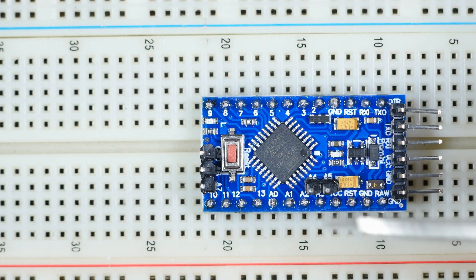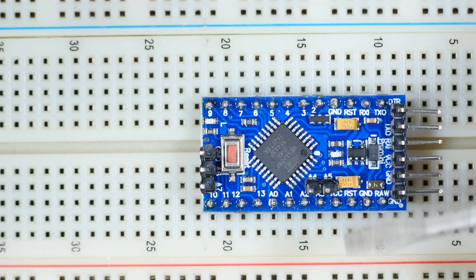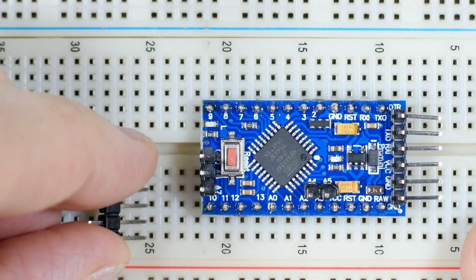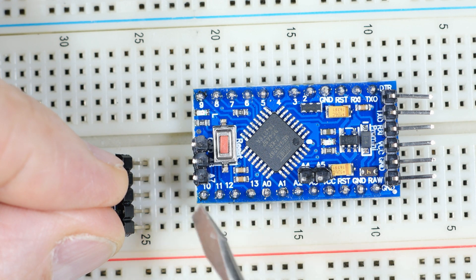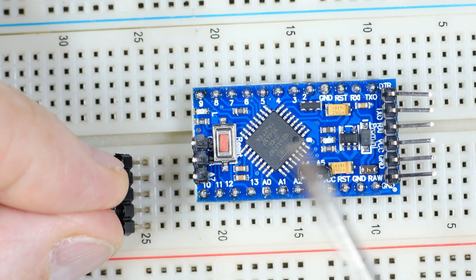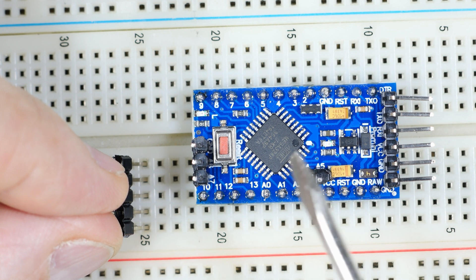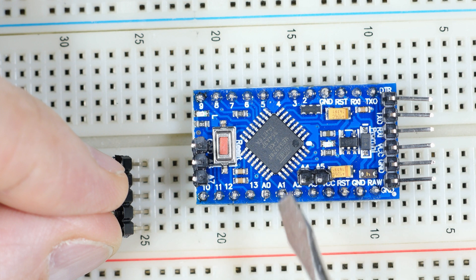Even if these pins lined up — like these three back here — why did I put these three standing up? Why would you not go ahead and put them in, assuming they were lined up and would match the holes? Well, these holes right here are all connected together in a row. So if I put this in here like this, all of these would be shorted together. In other words, if these were pointed down and poked into the holes, these would be shorted together — and this pin and this pin would be shorted together. So when you're soldering in these connectors, you need to consider how you're going to connect things, whether you're going to use a breadboard or jumper wires, and whether you want these pins connected across. Lots of tips and tricks today for something that would appear to be rather simple. Hope you found it useful and interesting in your soldering and home electronics projects.